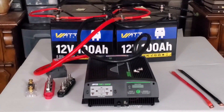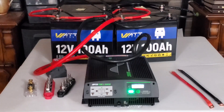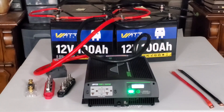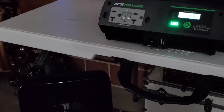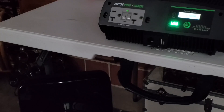And with that, we are set up and ready to go. The inverter shows system normal — that's good. The DC input voltage is showing five out of five bars. Again, that's 13.6 volts at 400 amp hours, which equates to 5,444 watt hours. And then I have the inverter set up with a 1,300 watt space heater to do the capacity check.